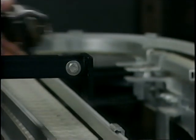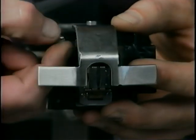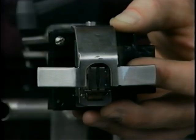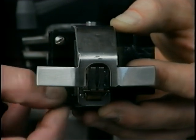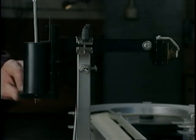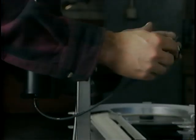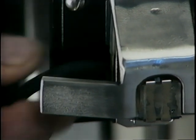Install the printhead to the printhead swivel bracket with the 2 screws provided. Make certain the printhead guard is in place. This guard protects the head from damage in the event of container impact on the production line. Now connect the ink line to the bottom of the pierce bar located underneath the ink septum. If it is too long or too short, the free flow of ink will be affected. Connect the other end to the printhead input tube.